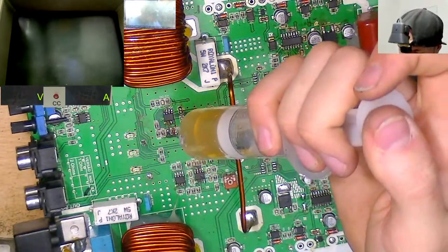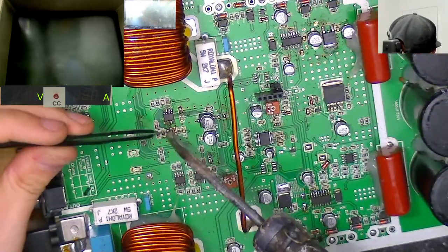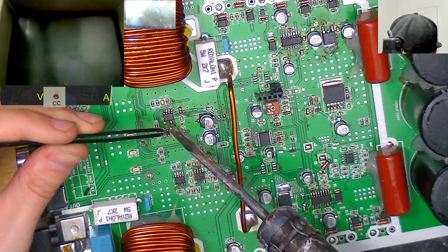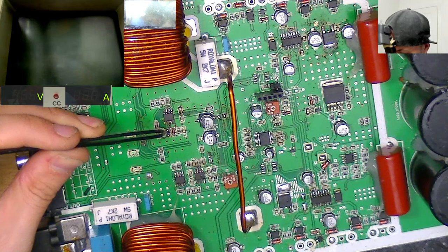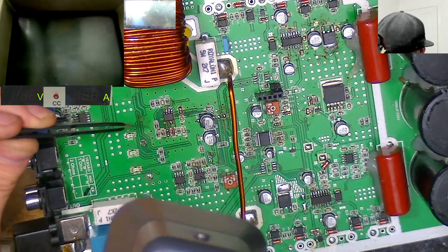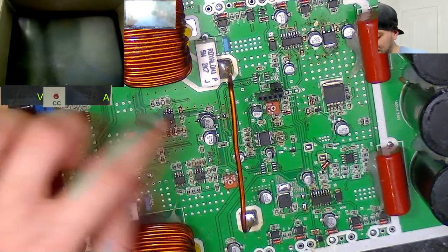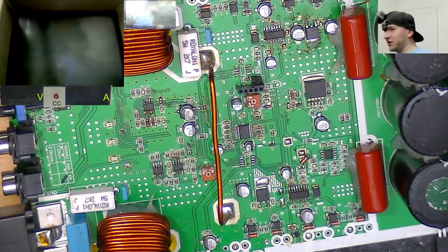Thing is, because it's an intermittent fault, I don't know if it's actually going to produce the fault or not. It seems to only do it when the board is cold, so I think it's got something to do with one of the 072s in the PWM generation area. So yeah, we need a 4R7 in that slot there as well. It's cool, we can grab one of those.